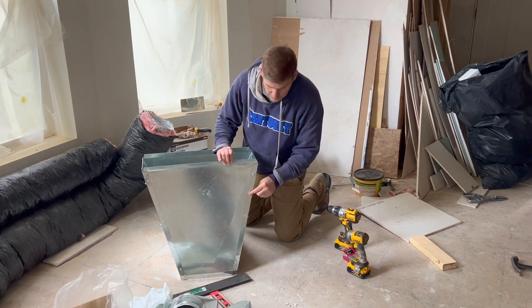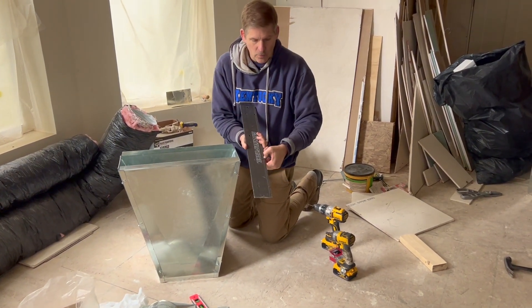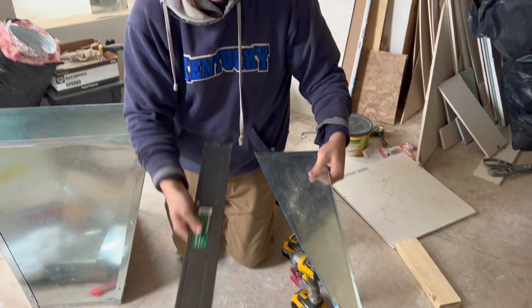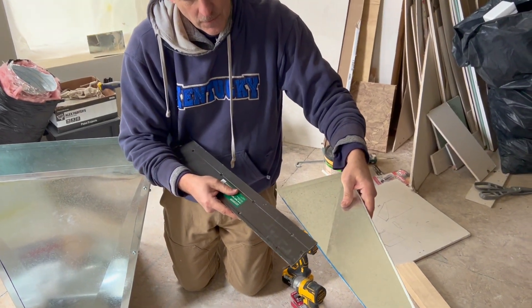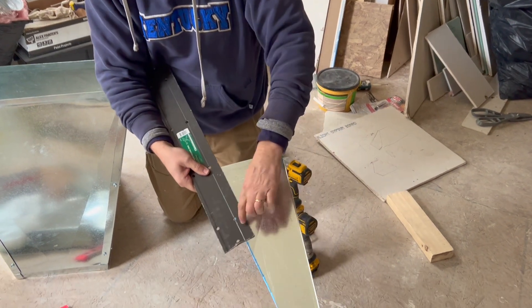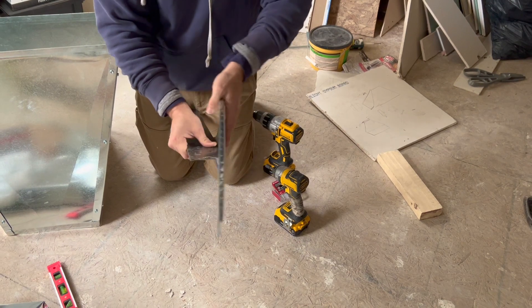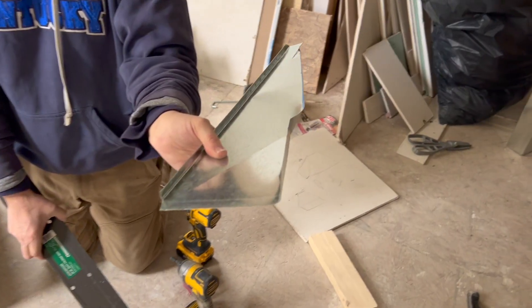It's all about trapezoids. Basically what he's done — you've got this brake and it has a one inch side and a quarter inch side on it. You can slide this across it, it seats in there, and you just bend it and it creates a real quick edge like that.